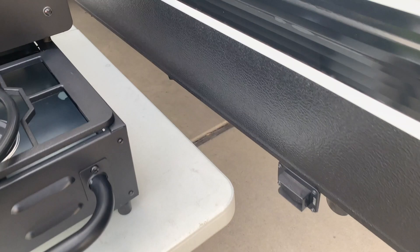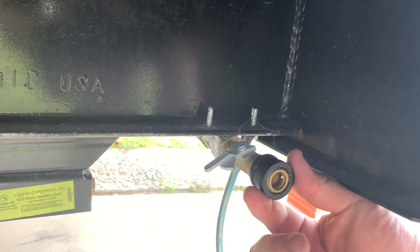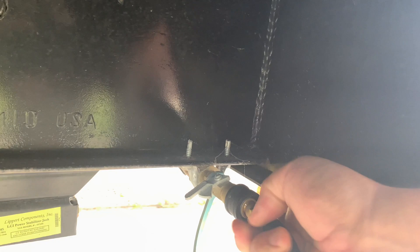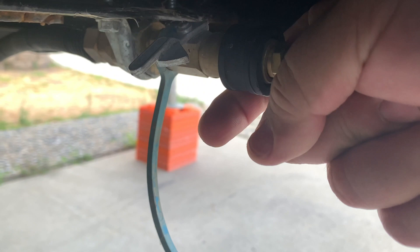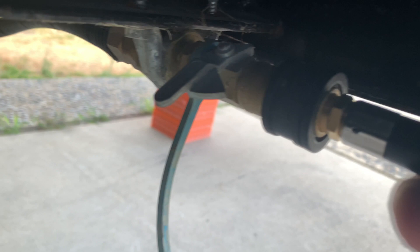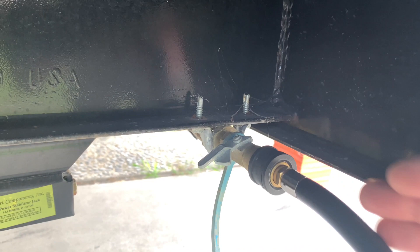So let's do this quick connect real quick. I'm going to take this cap off, push back on this thing here, and then you're just going to push it in. I can't do it with one hand here, but let's give it another shot. It's in — see that? Give it a little tug and it's not going anywhere. Now this is your shut-off valve; right now the valve is in the off position. We swing it over here, parallel to the hose, and it'll be on.